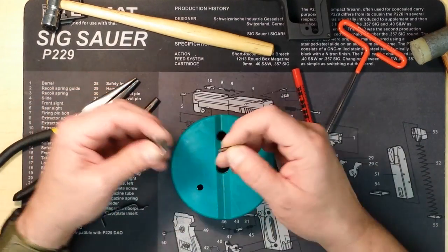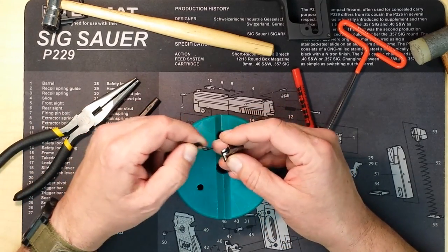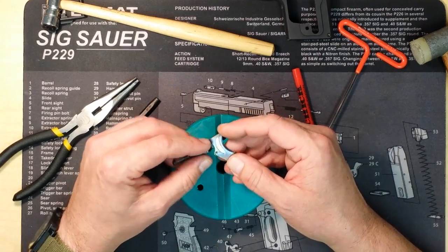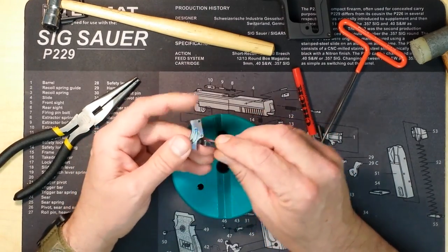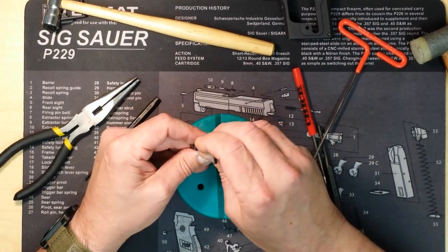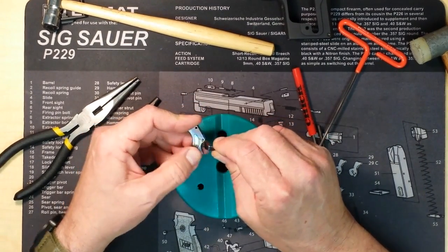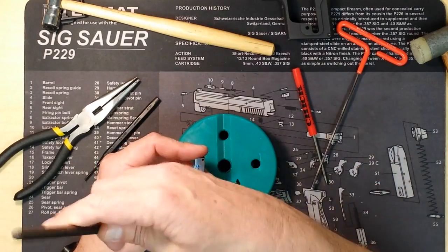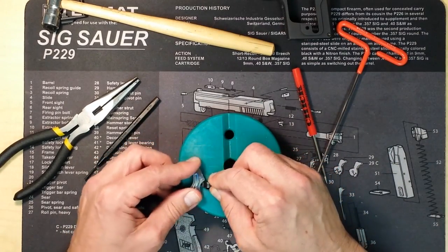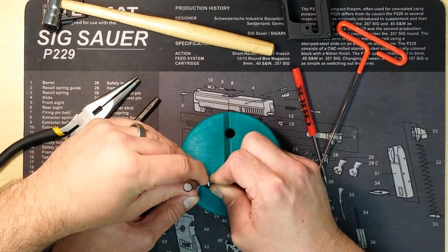Next, install the spring from the bottom, and this is the tricky part, and usually I need a hand doing this. So what we want to do is insert the trigger bar underneath the spring. The spring sits down in there and you can see it. You want to get it up here, start, and push. Once you push it into place, your trusty assistant will have the 1/8 inch dowel pin and the hammer, and they will then knock it into place.